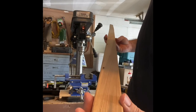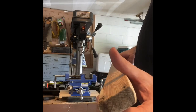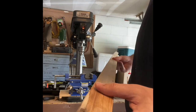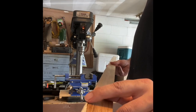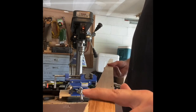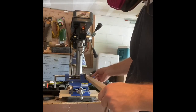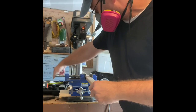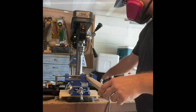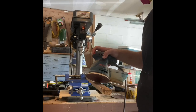And now, just in contrast to the other side, bang, you can see how much raised relief that is. So when I'm coming in with my sander, I'm angling the sander to where it takes this down till it's nearly flush, and then I'm sanding the whole surface to get it smooth. And I'm using 220 grit sandpaper. I'm sorry, 120 grit sandpaper. It's a little bit coarser.